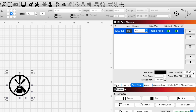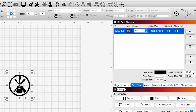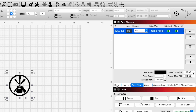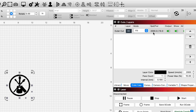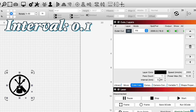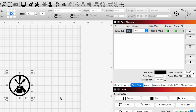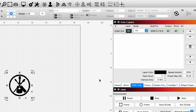For engraving projects, the 10-watt laser head is able to reduce the strength while still marking. Whereas the 20-watt laser head, you really can't reduce it past — I think it was like 17 or 20% — and at that point it just doesn't really mark at all. The 10-watt laser head you can go down pretty far and it will allow you to do that. We already tested this out on denim, and we'll show you the settings here: we've got the speed at 2,000 millimeters per minute and a max power of 10%, which is pretty low. That gives us the best results. We can leave our interval at 0.01, which gives us a really detailed engraving. If your power is too high, it's probably just going to end up cutting — it will just burn right through the denim really quick. But this setting seems to work for us.